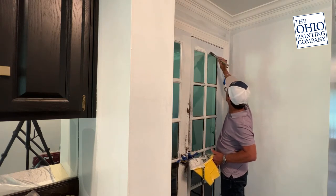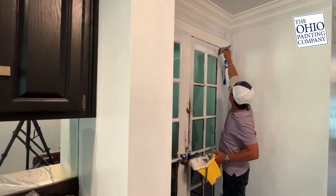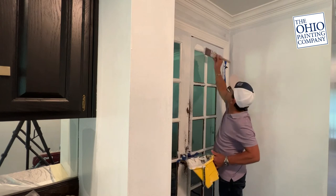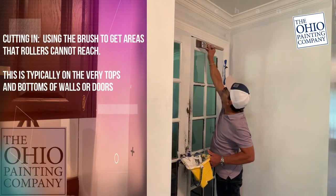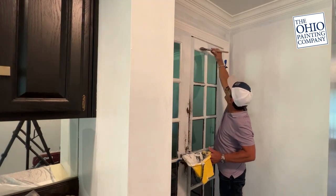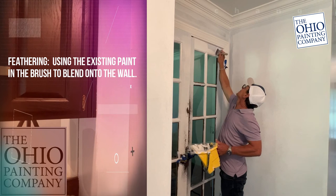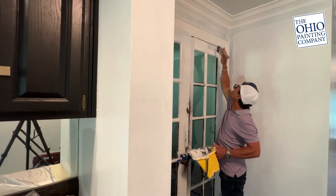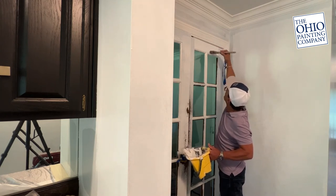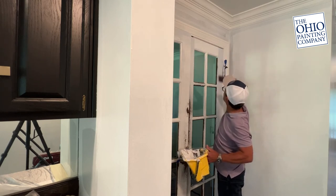The proper thing to do here is to go ahead and knock these edges down. Don't go outside of the square, but since this is all complete up here on the first coat, I would cut this in to mimic the wood grain. So we're just gonna make a nice line right there at that jam, at that intersection, and feather that out to the middle, grab a little bit on the other side just to get into that board. Just put a little paint on the window. Once you get this technique down and you've got a good solid pattern, your brush strokes are going to be nice and even because you're always going to be following them.